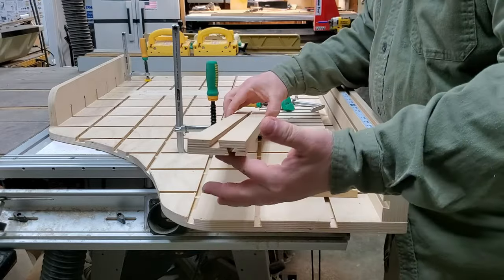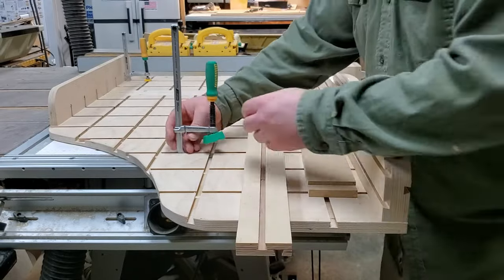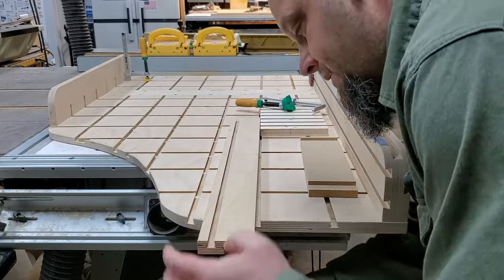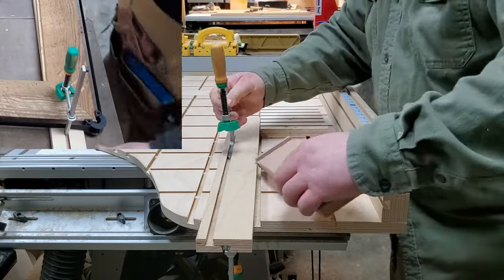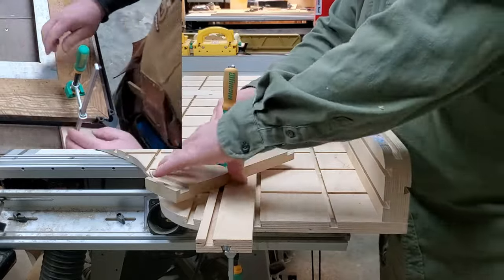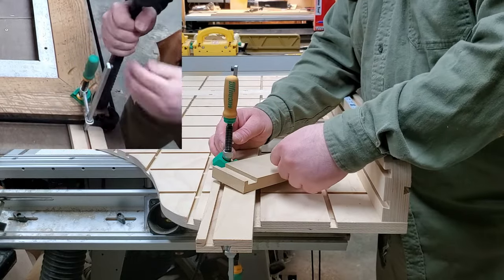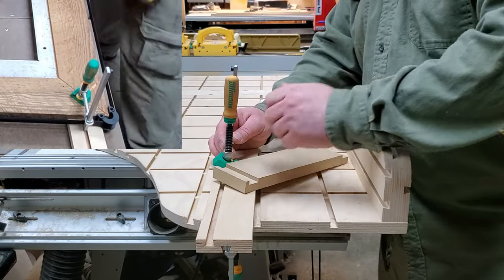and added another feature. Well, I have my top groove, but I also have one on the bottom, or I can flip these over whichever way. And how this works, essentially, you slide that in from the bottom. You now can clamp this piece down to your workbench or whatever, slide this in from the other end, and now you've got the ability to either hold down and route, or if you're trying to make sure that two parts are flat, like if you're making an angle, like on my picture frame, which is right here, this helped me ensure that both angles were held down tight to the table while I ran in my pocket screws, and that does really well.